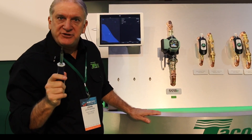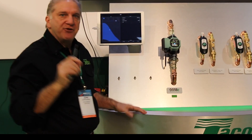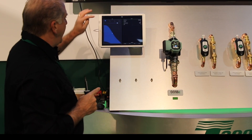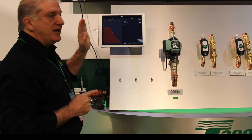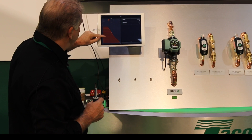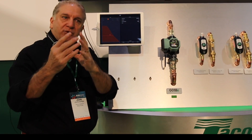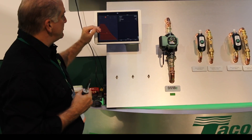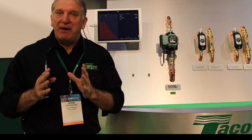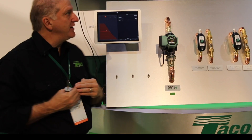Now to program this for constant pressure differential — which is what you want to use for zone valves — I'll turn my dial all the way to the left until I'm in the read-write Bluetooth mode. Not only will my app read what the pump is doing, I can use the app to tell the pump what to do. By pressing my constant pressure button, I now have nine different constant pressure settings to choose from. Just by touching the screen, I program the pump to just about seven to eight gallons a minute, and you'll see my operating point starting to move and adjust to that line.